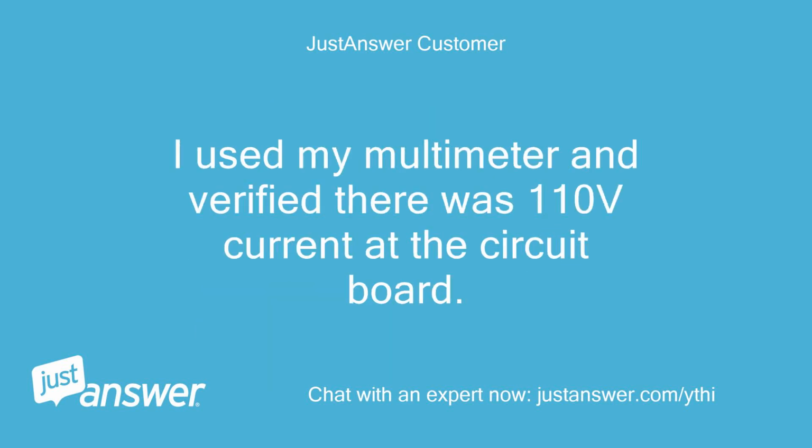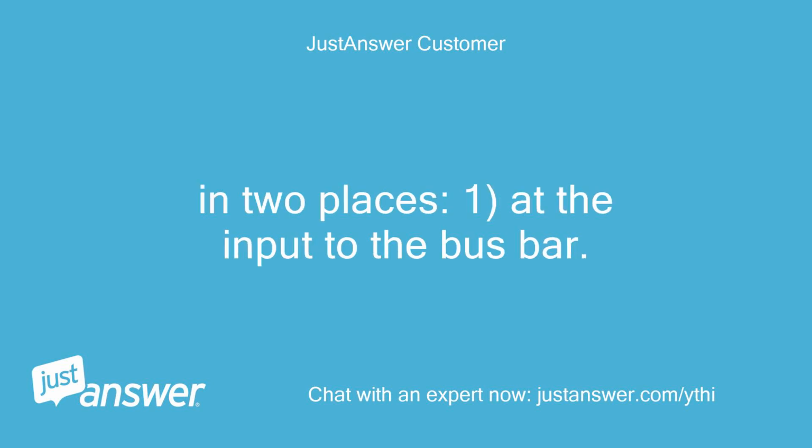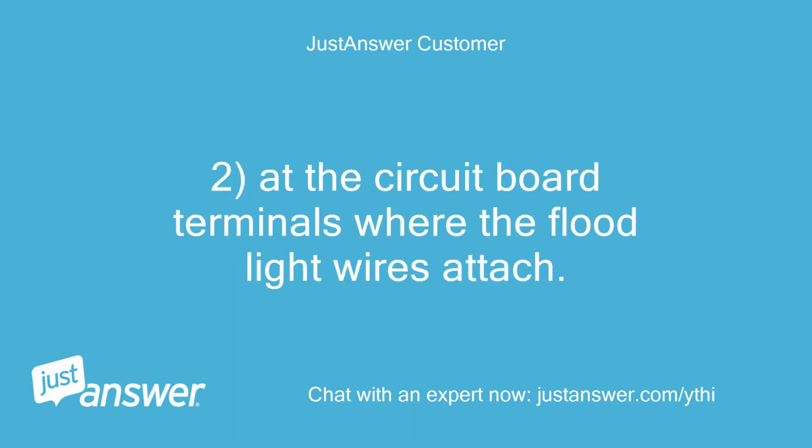I used my multimeter and verified there was 110 volts at the circuit board in 2 places: 1, at the input to the bus bar; 2, at the circuit board terminals where the floodlight wires attach.